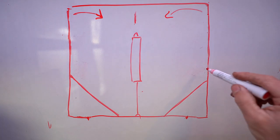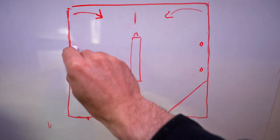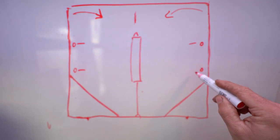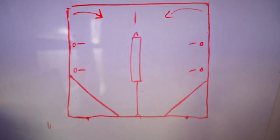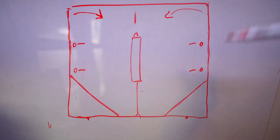So what I'm going to do is get some nylon rollers, something similar to what you would see guiding a slide-out gate, and put them inside each leg with a tensioner bolt behind each one so I can tighten them up and put more pressure on the legs if I have to. These rollers will push the legs into the stainless steel channel, which should keep it more square, and it'll also allow me to put a bit more pressure on one side if one side is extending faster than the other, helping to square it up and give it some fine adjustment. I'm pretty confident I'll be able to get everything we need from the local hardware store.